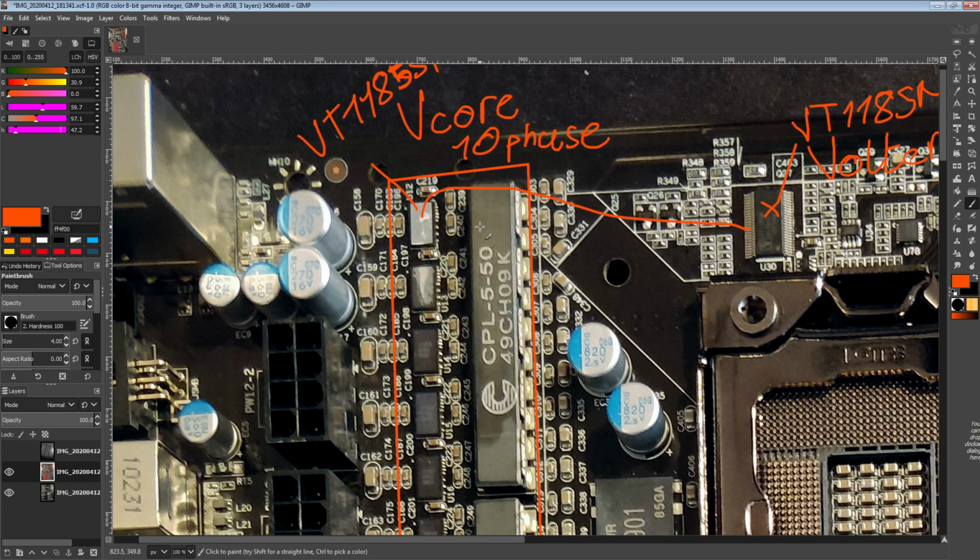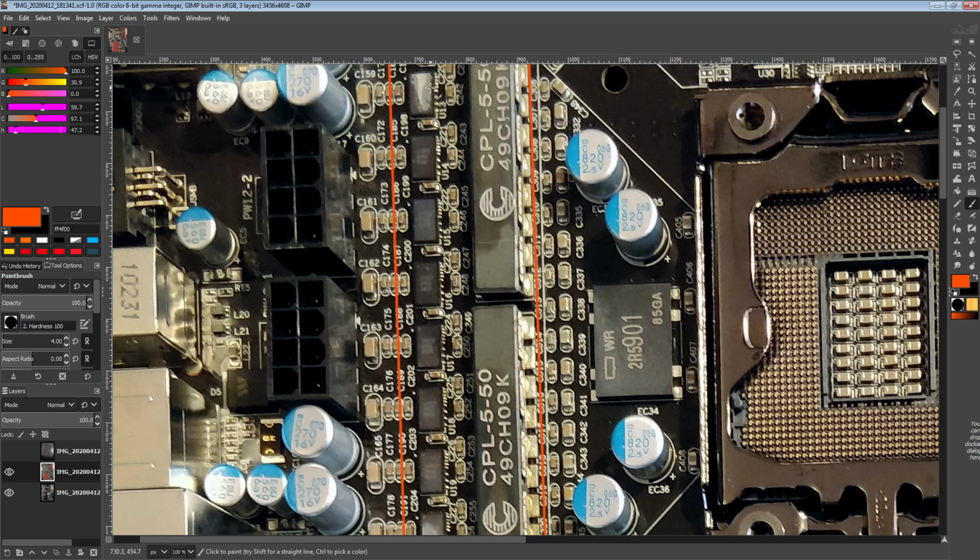the idea is, in a normal non-coupled VRM, if you turn on the high side MOSFET of phase 1, then the current through phase 1 starts to increase. Meanwhile, the current through literally all the other phases is decreasing.